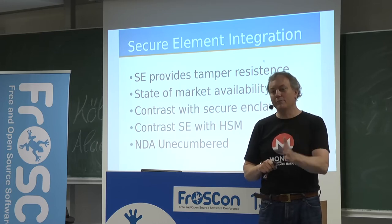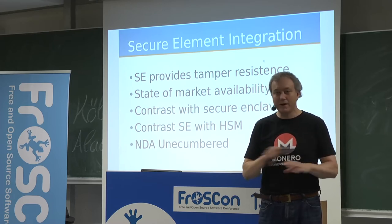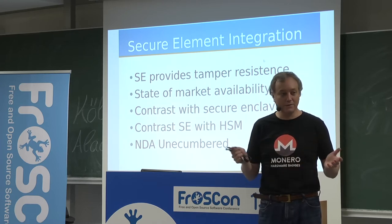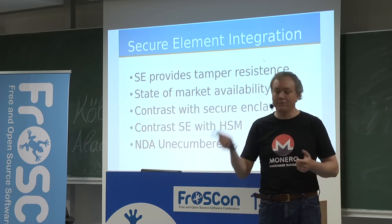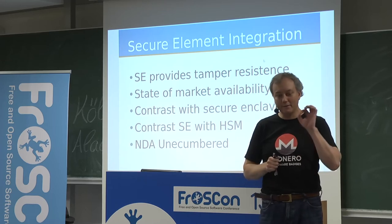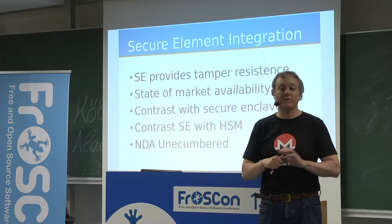So after that moment that you destroy those lines by blowing a fuse, you can never again inspect the private key. Your private key is not accessible to you, never again. You can't copy that onto a USB token or anything, over the internet, send it, stream it, anything. You can't do anything. That private key is in the hardware, stored there securely forever.